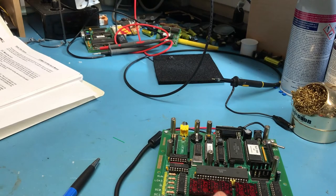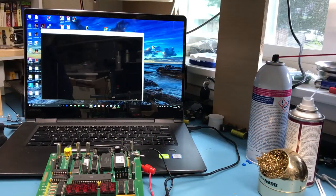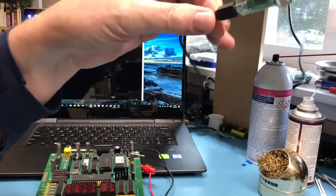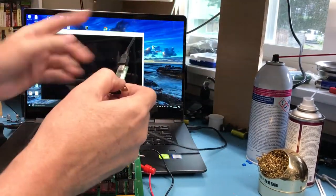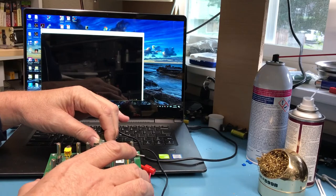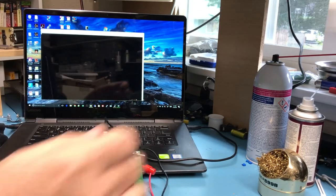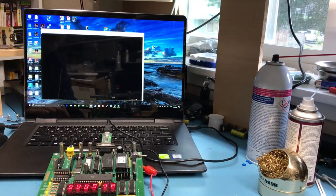let me move on and see if we can figure out what the next steps are here to get some life in this guy. So at this point, I've got my trusty laptop out. I've got a USB RS-232 adapter here plugged in. It installed as COM3. Tera Term is connected to COM3. We'll just plug it directly on here and see if we get lucky. So, bring the power supply up and we'll see if we get anything that appears to be serial monitor data,